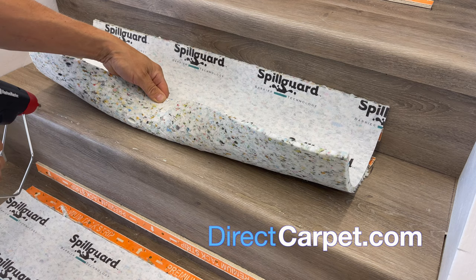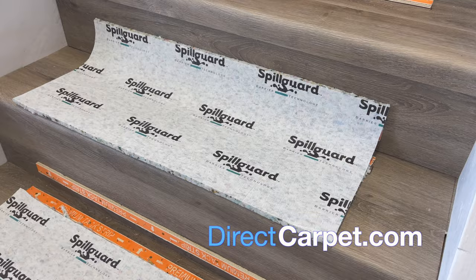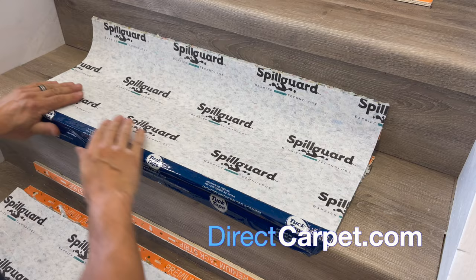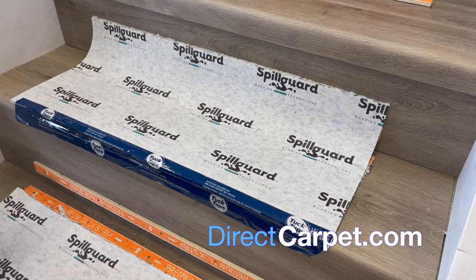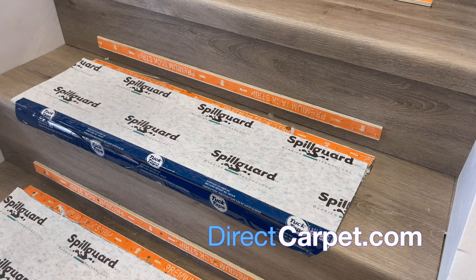Okay, I'm gonna slide it into place, nice and even along the front nose. And then, just in case, I'm gonna put a piece of tuck tape all the way along the front, and then wrap it down, hold it into place. That way, when you go up, it won't fold the underpad, right? It's glued, and it's got the tape. Okay, take a sharp blade, cut that off against the smooth edge, and then we'll continue to finish the rest of the way up.